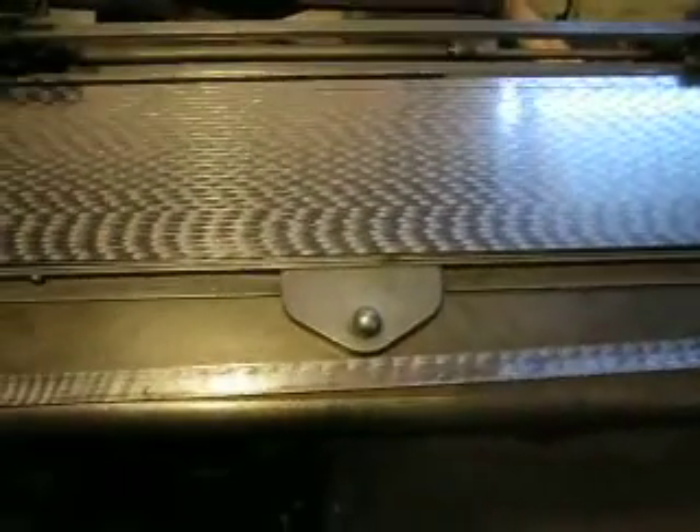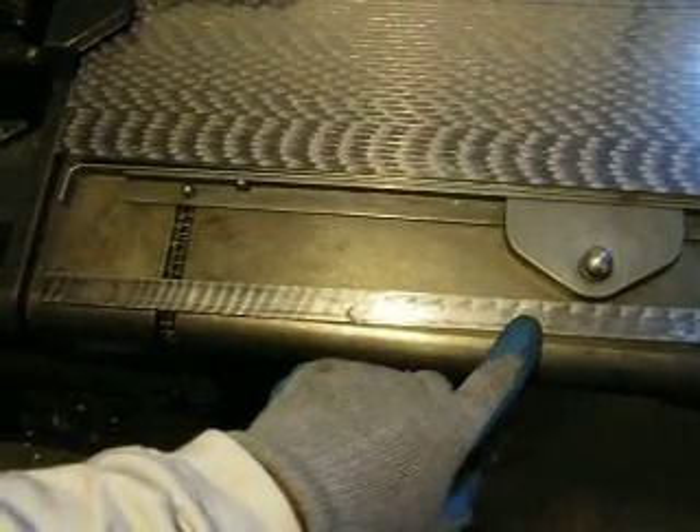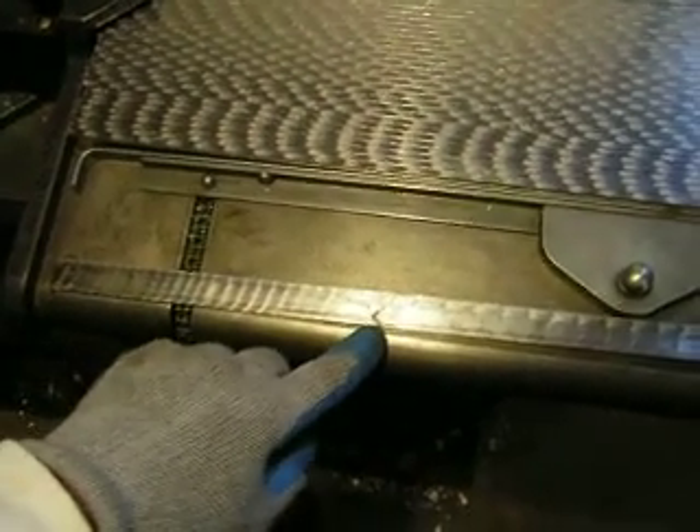This strip down here in front is the starting strip — it's the strip that originally began. We had this original strip on this side here, and we shoved it into the mold. This is the new strip, and right here is the fusion point where the old strip was pulled out and the fresh hot metal solidified and got pulled behind it.